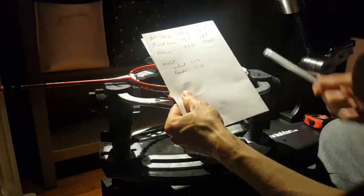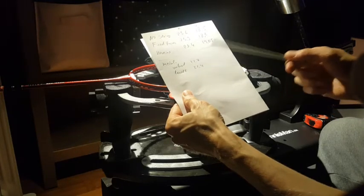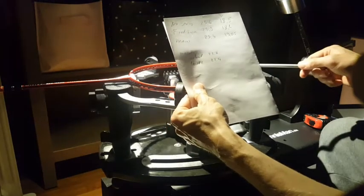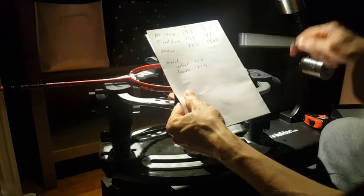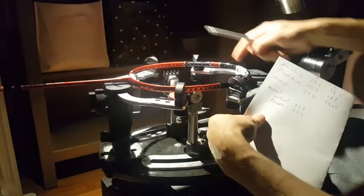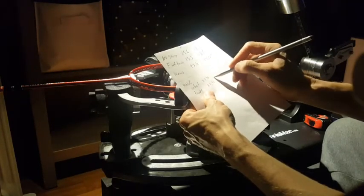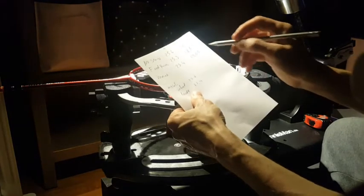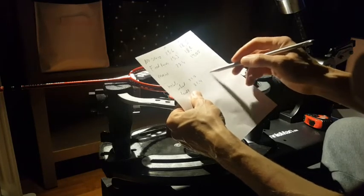As you see, the result of my experiment, here we have 3 millimeters deformation between metal parts that are completely fixed to the turrets. So this 3 millimeters is deformation of the machine itself. I don't think this is a lot. Maybe I saw it with different rackets and different starting conditions, maybe up to 4 millimeters, but 3-4 is okay.